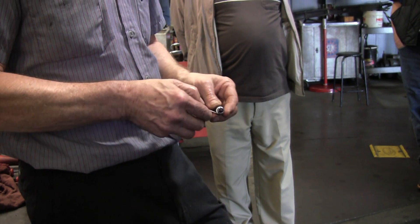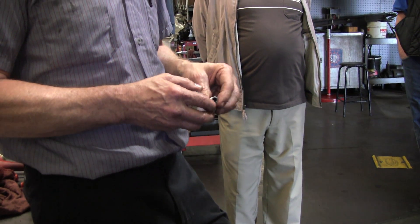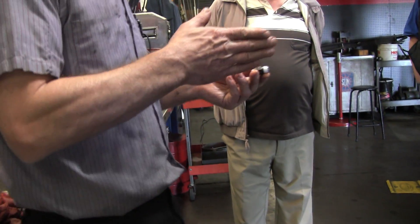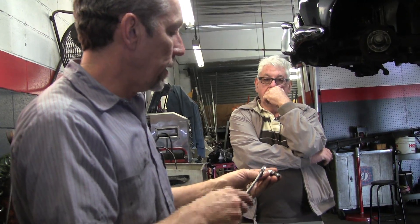I always wrap in the direction of the screwing, and I don't go to the end because I don't need the sealing there. Another thing you've got to be careful of — it's tapered, so if you keep tightening it, it's going to break whatever it's screwing into, and I've seen these crack before. In my opinion, it's because they don't hold this on the backside for the tubing fitting, and it keeps leaking and they keep trying to tighten it. That's stupid — that's my opinion.